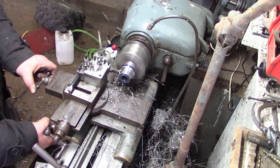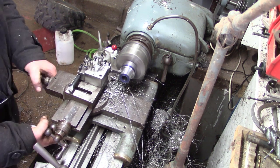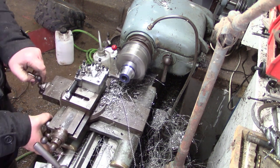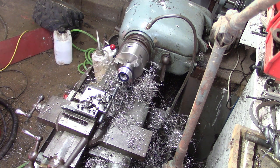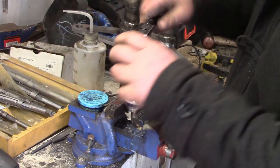I just got myself a radius cutter as well - it works incredibly well for turning down weld, but I'm using it for its intended purpose here, actually cutting a radius. Not because I had to, just because I wanted to. This end has got a step in it and some heavy chamfers to take the flat plate that I'm about to weld on the end of it.